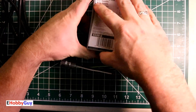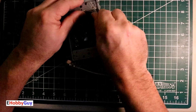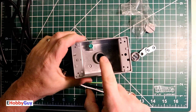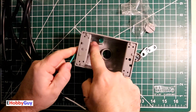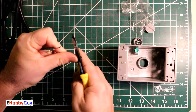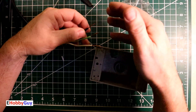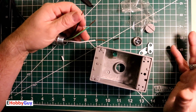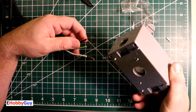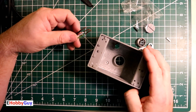Now let's bring in this guy here — I'll leave the part number in the description below. This green screw here — we're going to get this ground wire attached to this green screw. I'm going to strip these a bit longer. Now is definitely a very good time to bring up the safety factor here. We are dealing with US 110 volts and this is very dangerous. Please do not mess with this if you are not very familiar with it. Have an electrician do this for you. It is dangerous — it can kill you. Take extreme, extreme care.